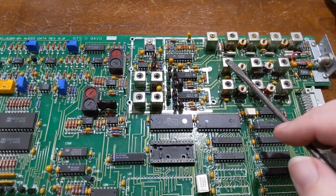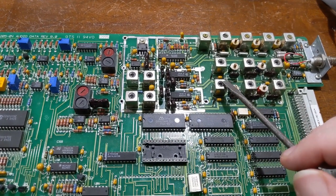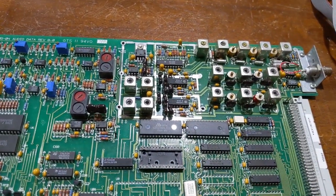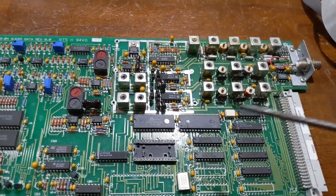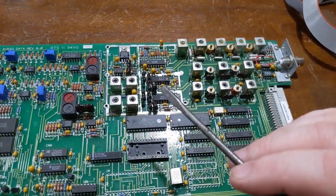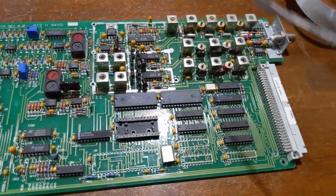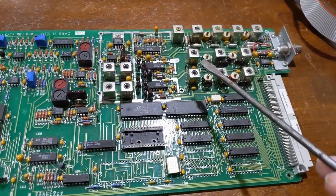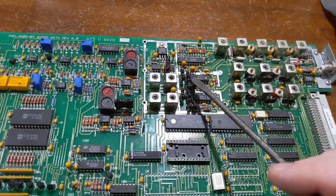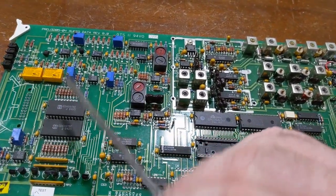So the Dan Chandler narrations or anything specific to the 4000 at that point in time could be sent through this audio carrier that's separate from the main carrier, main audio, the national audio. The national audio is encoded audio in the horizontal blanking period of the video cipher that has to get descrambled and decoded, but that's for a whole different video from somewhere else. I don't want to get into those details. But there's the IF strip for FM audio 1 and 2, and they come out over here, ratio detectors, amplifiers for each one, and then off into the muxing circuit.